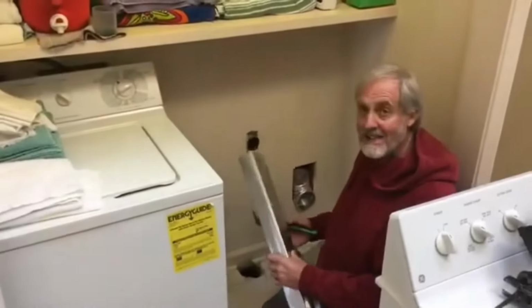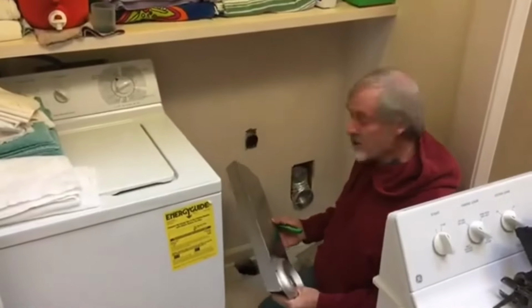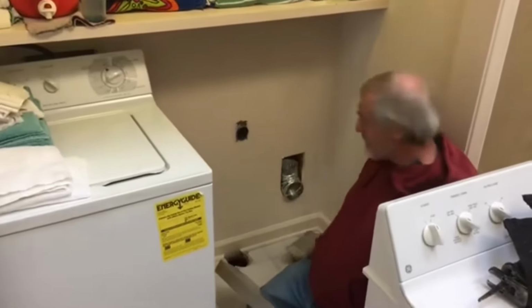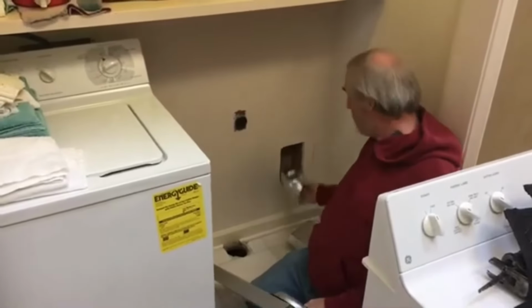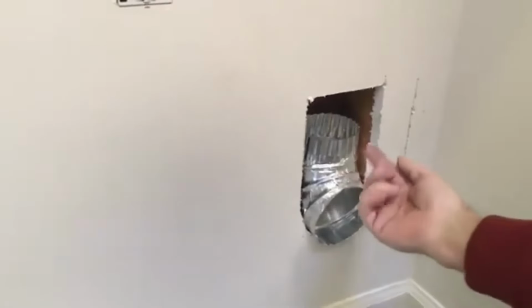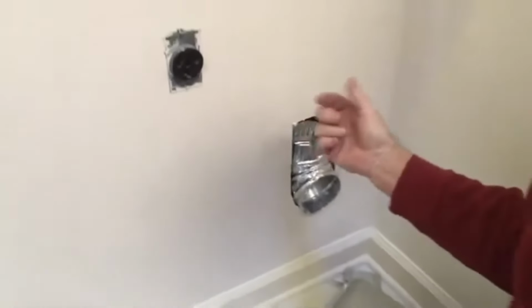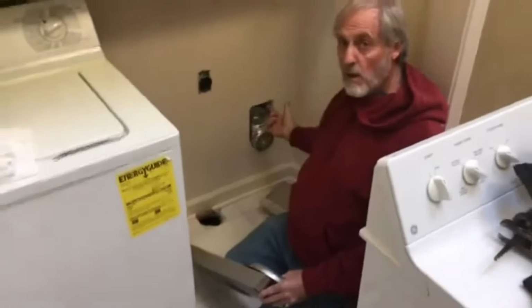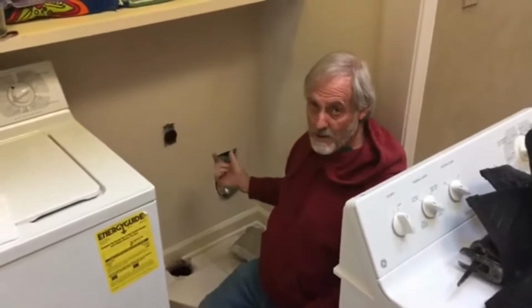We'll be back. Folks, as I told you, we're gonna cut the Periscope down and put an elbow in the wall, which we've cut the wall out, as you can well see. I put the Periscope in there to fit it. Now I've got to bring a pipe down that wall yet and put it in here, and you always want to crimp in the direction of airflow. So note, crimping goes up always in the direction of airflow.